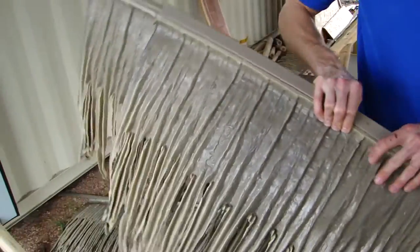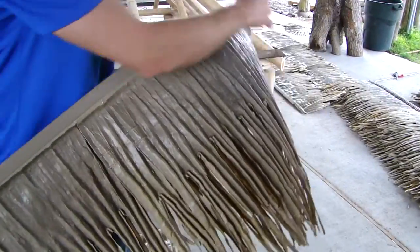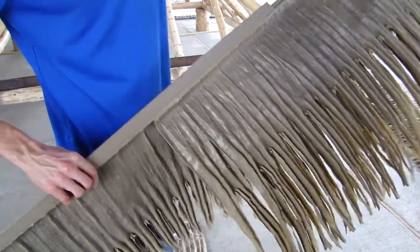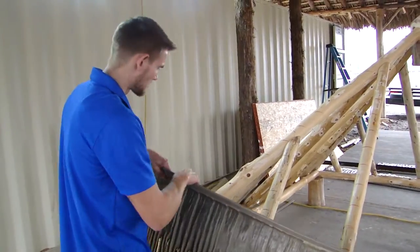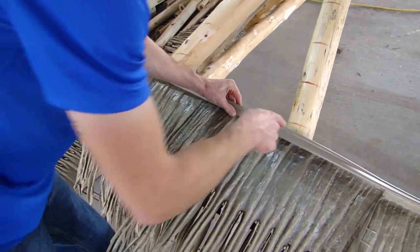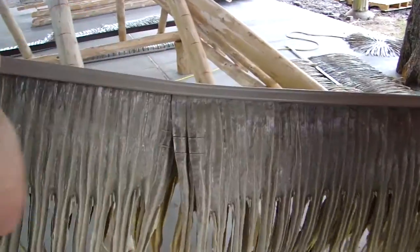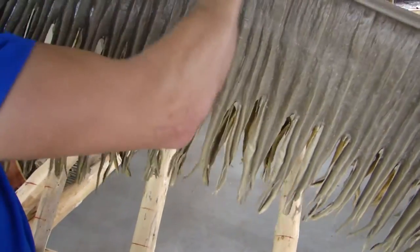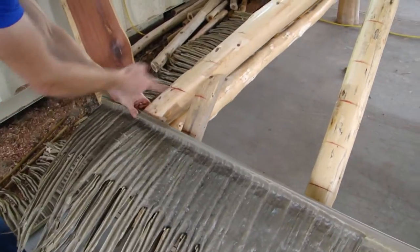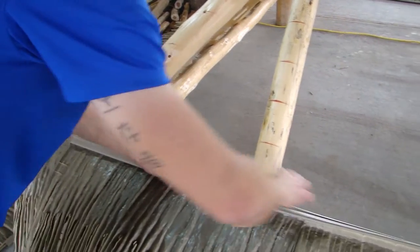When you put your leaves in on each row, make sure you've got at least four fingers overhanging on both sides. If you've got a little extra that's fine — we'll cut that later. Count one, two, three, four, make your cut, but you can install it as-is and cut it after. Each row when you put it up, you want to put it on your line. These rails are going to get folded over and then secured. Pre-fold it all the way down to make it easier when you're ready to screw it. Fold it downward, then put it up there, find your center where you want it, and secure it with the railing folded.